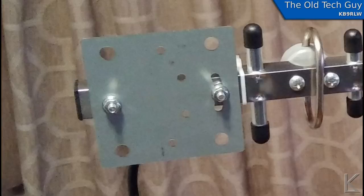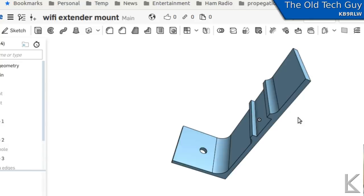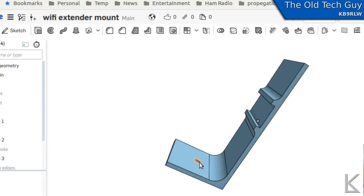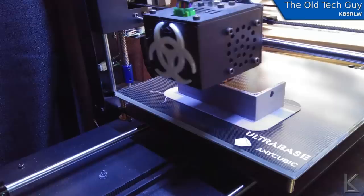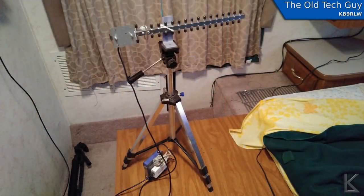A quick note on the Yagi antenna: it came with a mounting kit for a mast, but I wanted to put it on a tripod so I could just set it up after parking and point it out a window in any direction. I have a 3D printer, so I designed a quick bracket in OnShape where the antenna slots into the top and the bottom has a hole threaded for the tripod mounting bolt. The Yagi is solidly mounted on the tripod and I can easily set it up anywhere and point it out any window in the RV. All of the hardware is done.